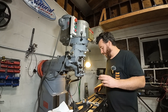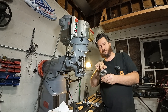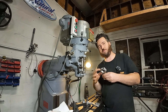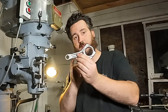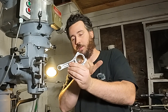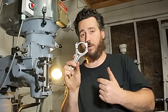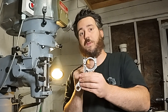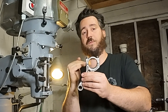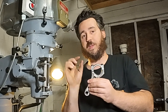So what is the plan? My plan is to actually fill the top side of this rod with weld, and then offset bore the rod cap to make up the difference. There are two challenges: one, I need to find that arbitrary center and bore it to the correct length between wrist pin and crank pin. Two, we've got this split cap here. If I were to leave this parting line between the rod and the rod cap where it is, then bore it in a different location, you'd end up with 55% of the circle on one side of the parting line and 45% on the other.